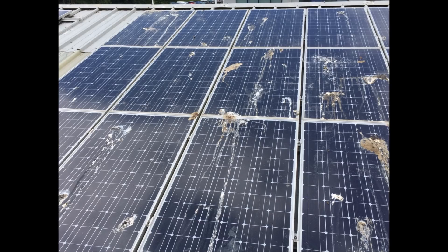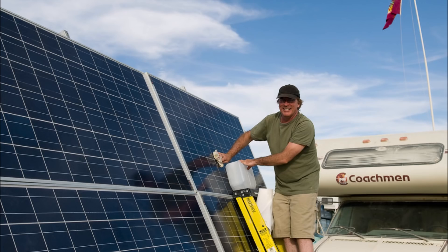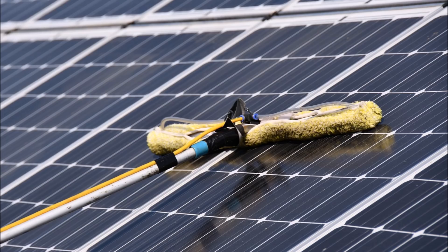Over time your panels will collect dust, bird poop, and pollen and decrease the power output dramatically. As I found out in one of my previous videos, which I will link to in the video description, you can lose 10 to 30 percent of the power you're supposed to get from your solar panels within just weeks of installing them. My mistake was I figured that the rain would take care of most of it for me, but I found out that you actually have to wash them by hand. So set a schedule and use some sort of non-abrasive brush and soapy water several times during the season to clean off your panels.